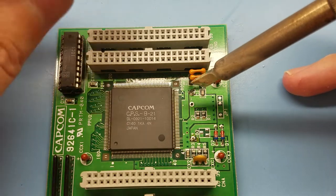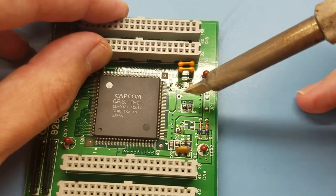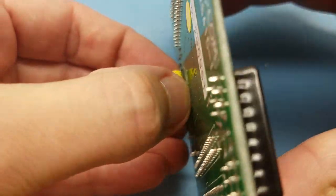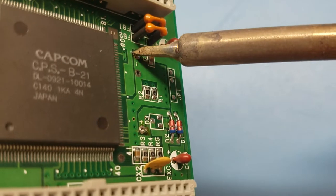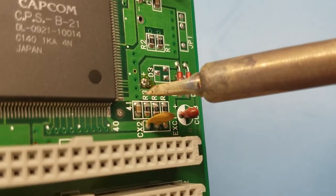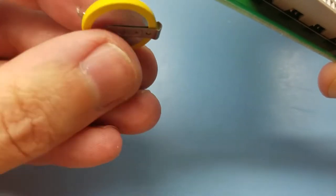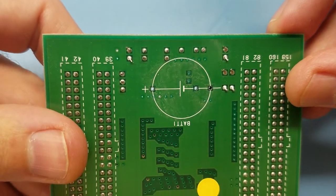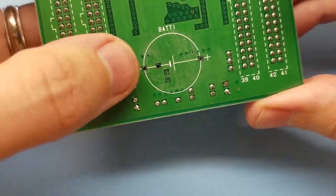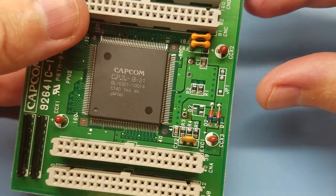Let me get that solder nice and molten and bend that lead up. At this point, you can either get a solder sucker and suck the solder out and then the battery will just fall out. Or if you're lazy like me, since those terminals are vertical, we should just be able to grab this battery from the back and then just by heating up the solder it should just pull through by itself. So there's our battery, and it is dead — I did check it with a voltmeter. Those holes could use some cleaning, but I'm not entirely worried about it. The main reason I wanted to desolder instead of trying to clip those leads is it just scratches up the PCB, and I don't like that. I like to keep it as clean as I can.